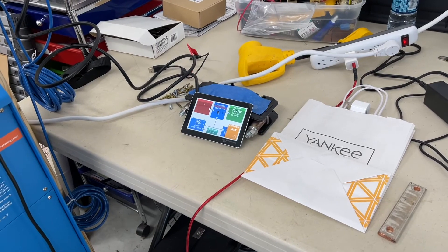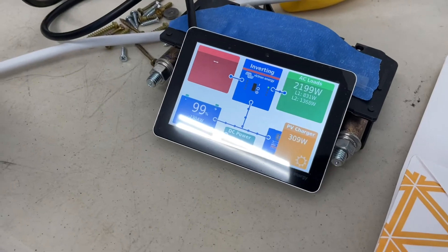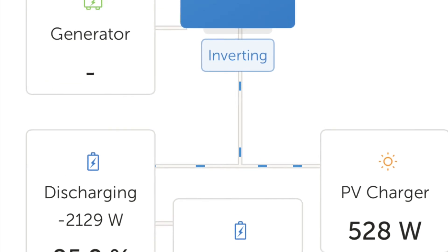Let's see if I can get this up to about 420 watts or so for the entire system — that would be a really good sign. And here you can see I'm at 423, 427, 430. After moving the panels and angling them towards the sun, we hit over 500 watts — and this is only 420 watts worth of panels. I'm getting that bonus because it's cold outside. Later in the day towards 10–10:30 a.m. I got even more than that. 528 watts — check that out.